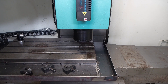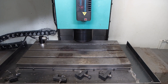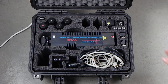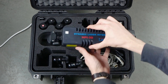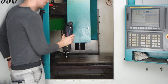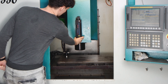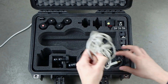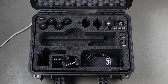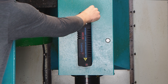Prepare the machine tool for device installation. Take the interferometer from the box and install it on the machine body. Keep in mind that you have to install it directly on machine operational parts, not on the body or some flexible details. Take the USB cable, the power plug cable, and the power brick from the box.